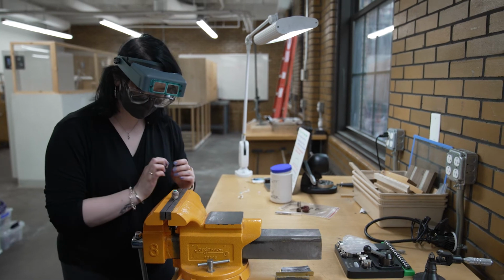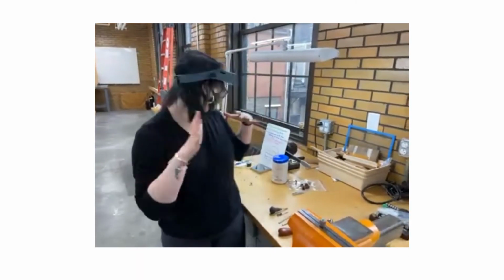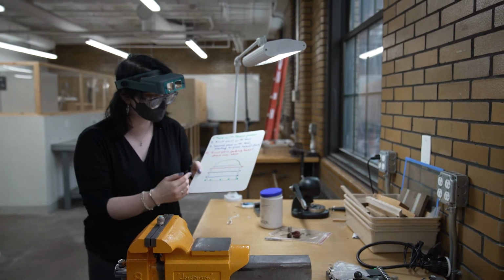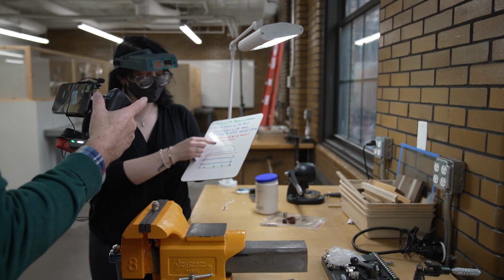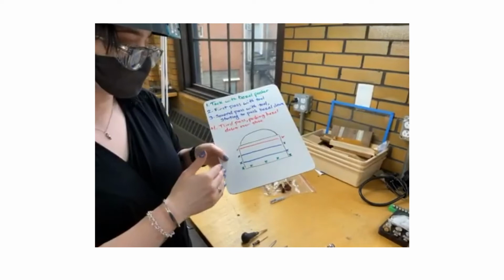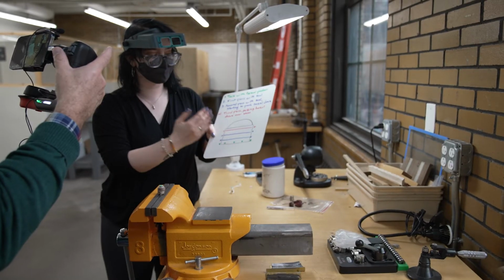So we've just got our little bezel and our little stone. Does the height of the bezel have any effect on setting, Joanna? It does. Thank you for mentioning that, Anne. You can't really see it in this drawing, but pretend you can. I drew it really well. The stone has a point where it breaks, where it comes up flat and then starts to round out. What we have to do with our bezel is come just above the point where it breaks so that we're holding it in, because if we just have the straight square bezel, it's not going to do anything.